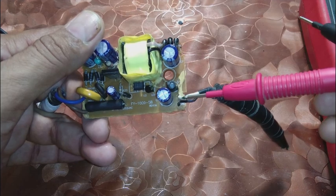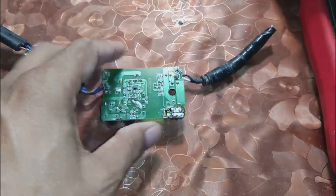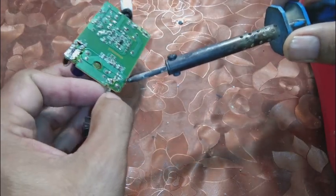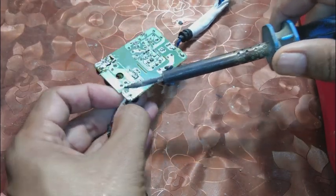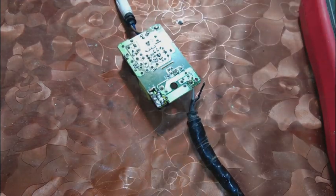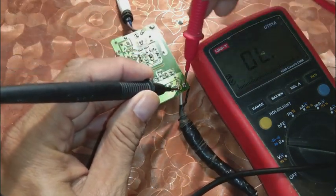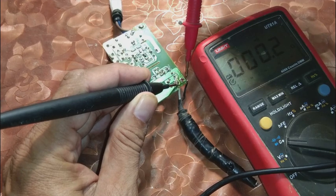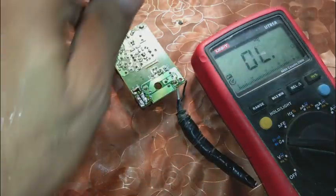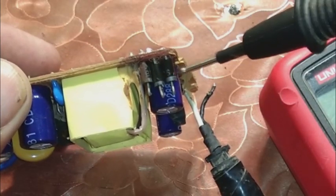In the secondary side there is a cable, there are capacitors that can be shorted, and diodes that can be shorted, or this cable can be short circuited. So let us remove one end of this cable and see if the short is still present or not. I removed this cable and now I am checking again — the short is still there on the board, so the cable itself has no short circuit but the problem is on the board.